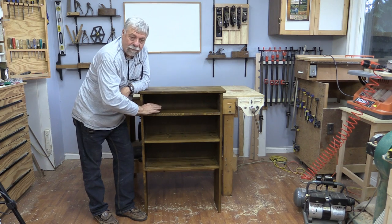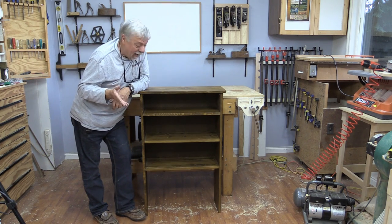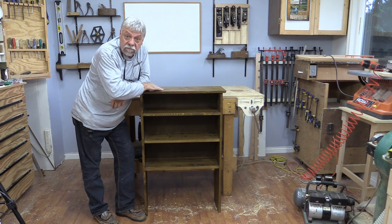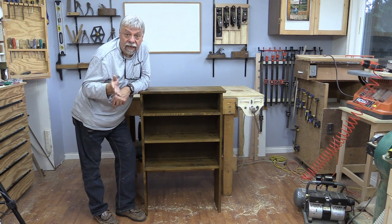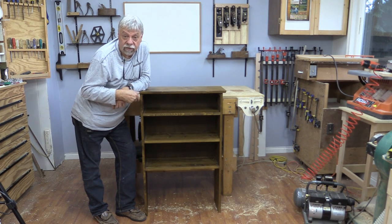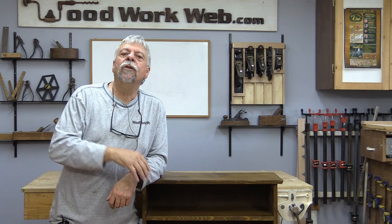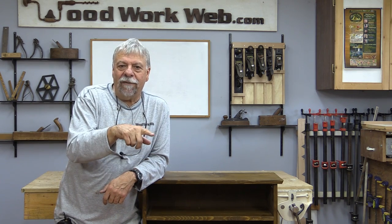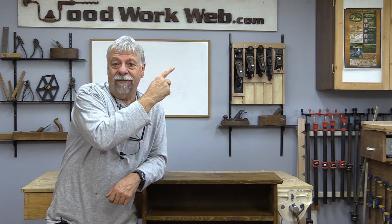Well, there it is — the finished little shelving unit for my office, complete with all the dust on the floor in my workshop. We just used some utility pine, did a custom dye to match other things in my office, and used a water-based varathane on it, and it turned out great. It's not a masterpiece, it's just a utility shelving unit, and that's really how simple it is to make one. Lots of different ways of making it — this is just one version. That concludes our video on making the shelving unit. Before I go, a quick shout out to Chad, who is selling some of his turned pens at an event I attended. Don't forget, if you haven't subscribed, please do that, like us on Facebook, follow us on Twitter. I'm Colin Kanan for WoodworkWeb.